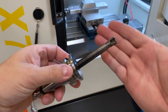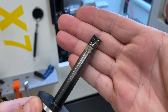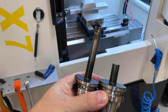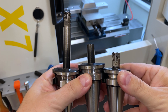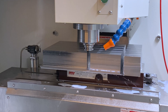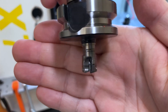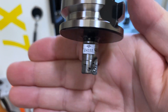The opposite of high efficiency milling is a very wide cut but a very shallow cut — that would be high feed milling. This is a little Die Jet cutter and I absolutely adore this tool. You can see there's one installed in the long arbor, the medium arbor, and the short arbor. The X7 has such fast rapids and enough rigidity and speed that it really makes feed milling very useful. I use this cutter a lot in tool steel, cutting a lot of P20 tool steel here, and it's really cost effective — it has three inserts and each insert has two cutting edges.